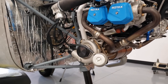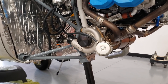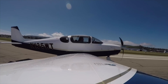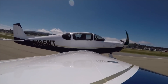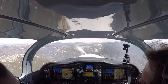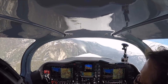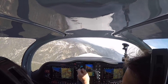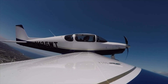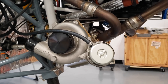The first thing I'd like to talk about is the turbocharger itself, which is right here. This engine is equipped with a turbocharger and it's also direct fuel injection, completely managed by a computer. What a turbocharger helps you with is that it allows you to maintain maximum power as you climb. With the 915, you have maximum power all the way up to 15,000 feet. You start off at sea level at 141 horsepower, and then it settles to about 135 horsepower, which you maintain all the way up to 15,000. Your normal mission for this airplane is probably between 6,000 and 9,000 feet, but you've got an awesome power range available all the way up to altitude if you need it.